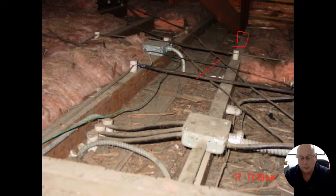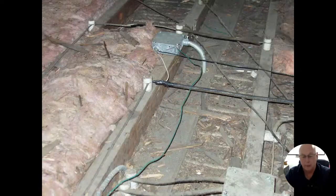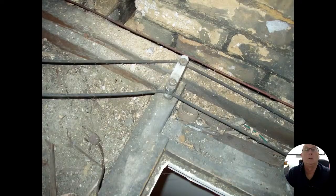All right. Now they took some of these old knob and tubes and they wanted to get some more electricity coming in here. So now we have a junction box. That's the right way to do it. All right. But if you look carefully and you see a little, I think it's a wire coming out of there, out of that junction box at the very top. It looks like we ran a ground wire and the neutral wire, and basically they just brought blank wires coming out of there. And I'm hoping we'll all realize, no, you can't do that. All right. Oh, they did. Here's a close-up of it. And this is the area that I was talking about right here. So that opening is 3 inches apart, and that's where they need to be.